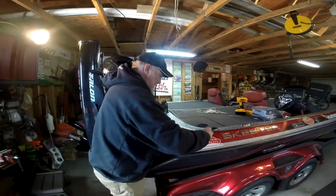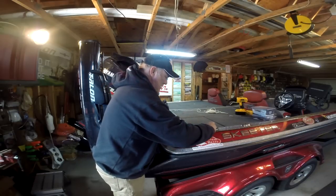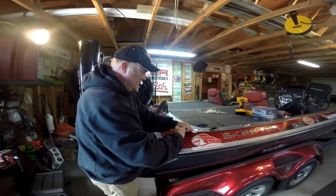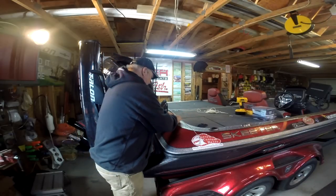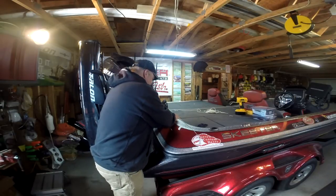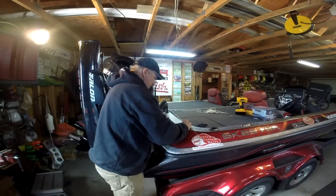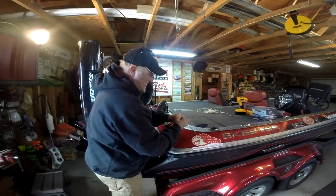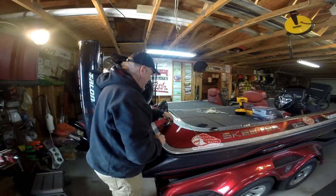Because there are electric wires and stuff, I'm getting a sensor reading right here — something underneath the boat in this position is moving the compass; it's turned it this much. I know north is pretty much that direction, but I'm getting some interference here every once in a while, and I'm definitely getting very severe interference in this spot. If you can see, it's pointed here where it should be pointed that way. So I want to try to stay away from here.